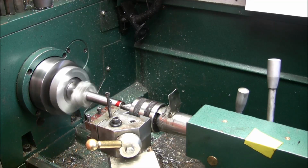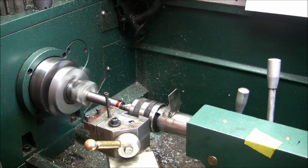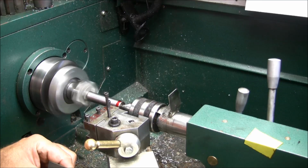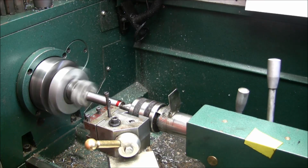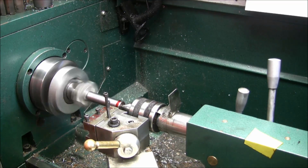And then back out to 71 thou. Crank over 65, yep, 65 and a half. And then crank in my 71 thou again. There's 0, 10, 20, 30, 40, 50, no oil. 60, 71. Back out. Okay, I'm going to zero my carriage again. So 65 and a half.